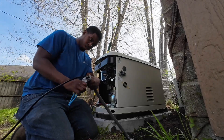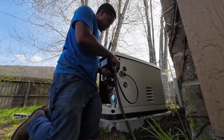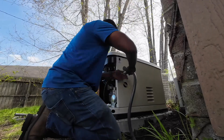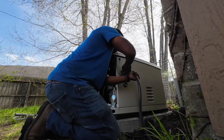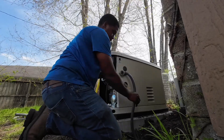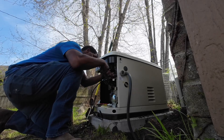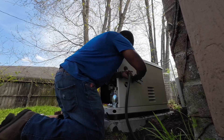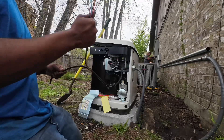Tightening all my fittings so I can get ready to pull the wire through and terminate it. As I'm pulling it through, I want to make sure I keep that form and fit. I think I left a little bit too much slack in there, but my journeyman said I made it work — everything was fine. I'm getting my flat head on my Kleins and tightening up my lock nut so we don't have to worry about it moving. Then I'm moving to get my channel locks to make sure it's tight on the outside so no water can slide in. Forming everything out, making sure it looks nice and neat.